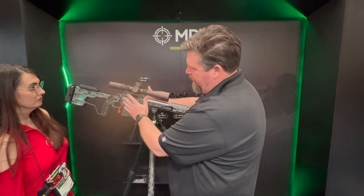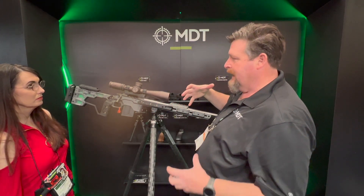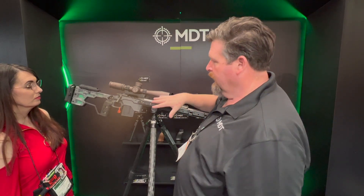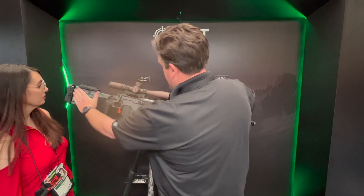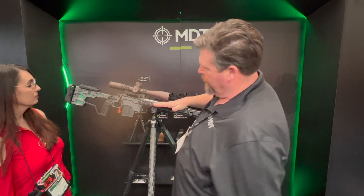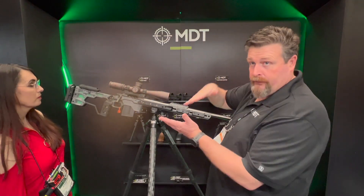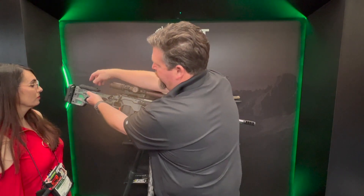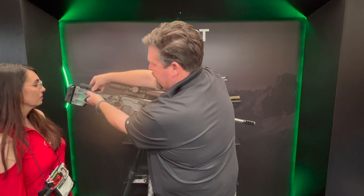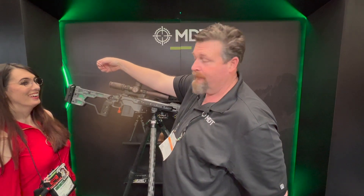We also stiffened this whole rifle up through this area here. All this is much thicker, much more rigid, just to make sure that all those vibrations were cut down and the rifle would track straight back. As we come into the butt stock, we've gone basically straight through here. By doing that, we're allowing all that energy to transfer straight into the recoil pad instead of getting tied up and flexing around the aluminum skeleton around the cheek piece. We also have an adjustable cheek rest — just up and down with a toolkit underneath. So if you need to adjust anything on the chassis, we have everything you need right there.